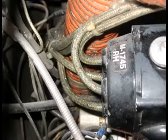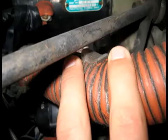You want to look for any abrasions or tears to the P-lead. Next, check around the engine mount for any abrasions. As you can see here, the A&P has added silicone to the fresh air intake to avoid any abrasions due to the engine mount vibrating in flight.